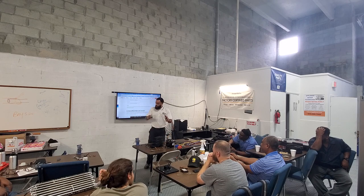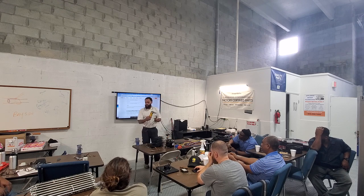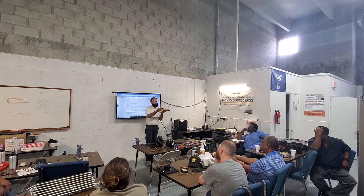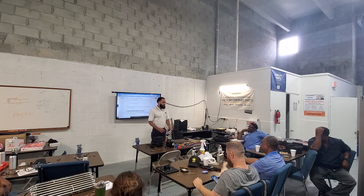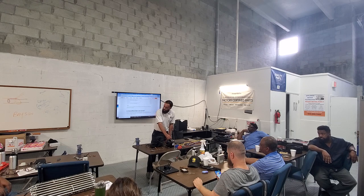First test you always want to do: as soon as you turn this machine on, you put the leads together, and you should hear that. That's the first test. Why? Because this thing is in your tool bag, it's bouncing in the truck, and you don't notice, but a screwdriver bumps up and this red one comes up just a little. And now you go to the compressor, and I did a sealed system on first call, and it wasn't even that. You understand? First test you want to do, always.